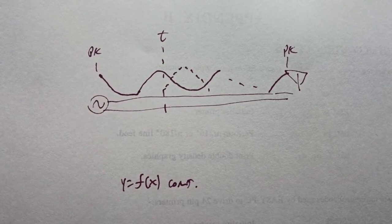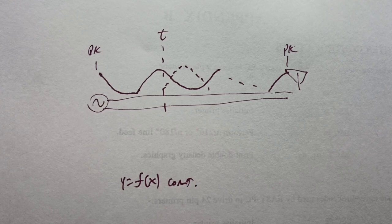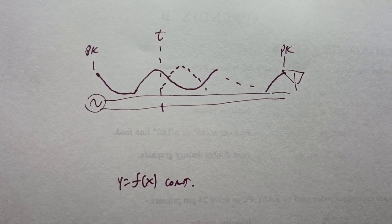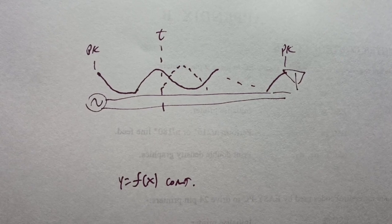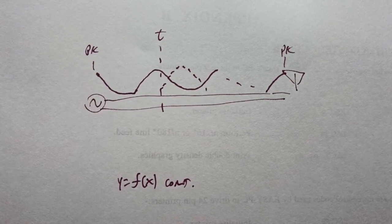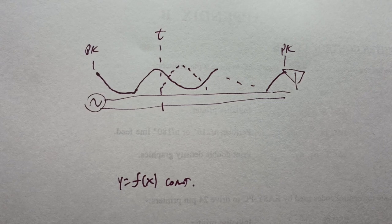But it's going to read maybe an eighth of the reflected current, way down there at the bottom of that dashed line. They're both cosine lines. But you can see the indicated ratio will look quite good because the meter's seeing much more forward current than reflected, when in reality the reflected current is about the same magnitude as the forward, and SWR is infinity. And if this occurs at the transmitter, it can destroy the transmitter.